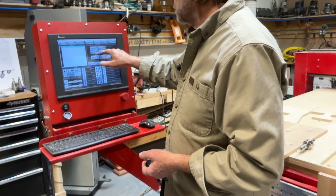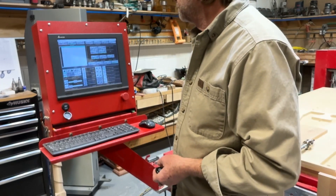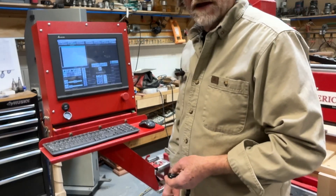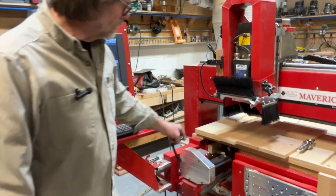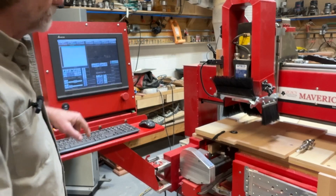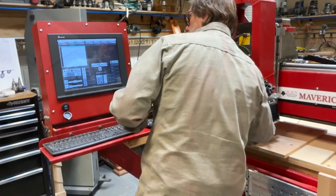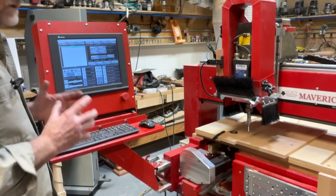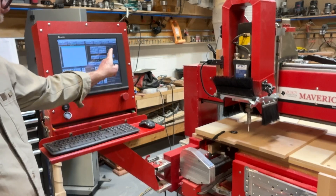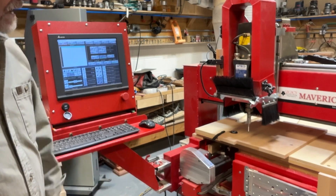So I'm going to say pick up my tool. My warm-up tool is being put away — that's the noise you hear back there. And now the machine's right behind me and ready for me to put the tool in. I simply release the tool using the button on the screen and get out of the way. Then I hit clamp tool and then hit the arrow so it knows I'm through with the tool change. If I look up here on the tool in spindle — the DRO says 12. So that's the tool it knows is in there. Tools in place, we're ready to jog it into position and find my edges.